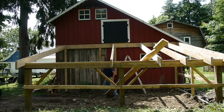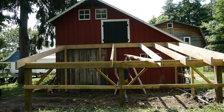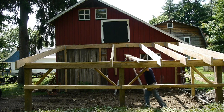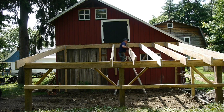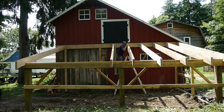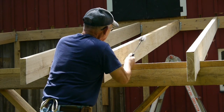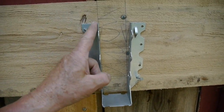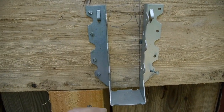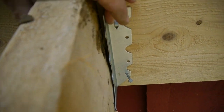It's easier if you have two or three people — one on each end of that 2x8 — but if you just lift one end at a time, you can get the rafter up in there without straining too bad. Sometimes you have to make some adjustments on that first rafter you cut out, just so long as you make that adjustment and then use it as a template for all the rest. They all have to be the same. Down on this end I just toenail in a couple nails on both sides of the 2x8 into the top of that plate. When putting those brackets up, I learned to nail one side and leave the other side open so you can drop that 2x8 down in, then pull it over and nail it afterwards.